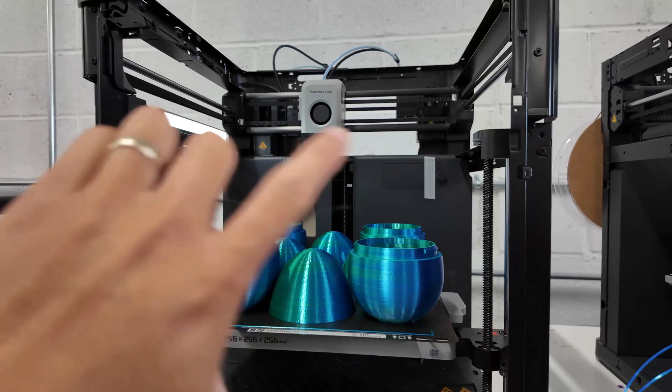On each of our steel shelves we have a small kit: a spray bottle with 99% IPA, a microfiber cloth, and Allen keys. After every print we spray down the build plate with IPA, wipe it clean, and restart the print. That solves 99% of bed adhesion issues.